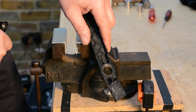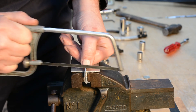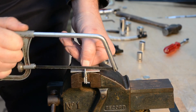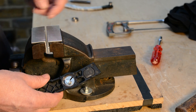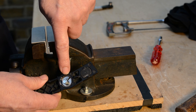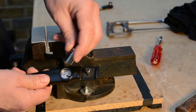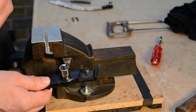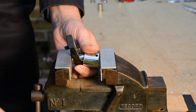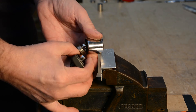Using a five pence coin, cut three quarters of the way across the coin with a hacksaw. We now screw a self-tapping screw into the slot — this makes the 5p expand into the bearing groove, allowing us to push the bearing out of the socket. Using a vise, the old bearing is easily pushed out.